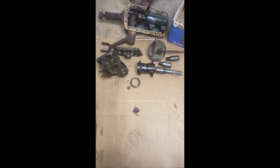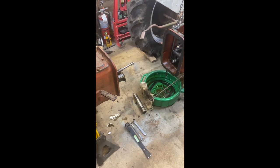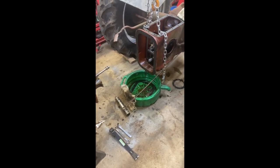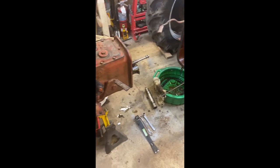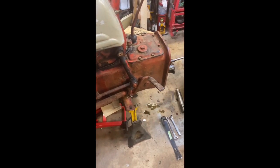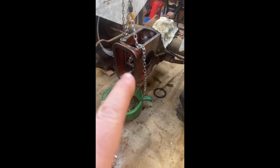Today I'll show you what I've accomplished so far. Please excuse the mess in my garage — we're obviously mid-project. For this Howard gear reduction to go in, you have to split the tractor right after the transmission. Here's the transmission right here. The front of that would be the clutch and your engine — so you've got your engine, clutch bell housing, the transmission right here. You can see the shifter sticking out the top and then your rear end where the hydraulic pump is down in there.